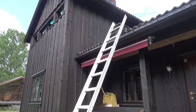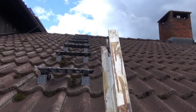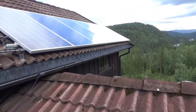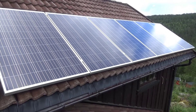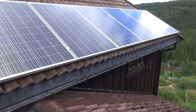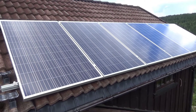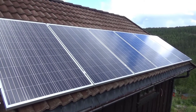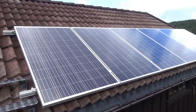So we're going up to the roof and looking at the panels. Here they are — six of them, wired three and three together in series, and then those two series are in parallel. They are giving out about 40 volts each, so I get 120 volts of power, which is within the range of this charge controller that I have installed.